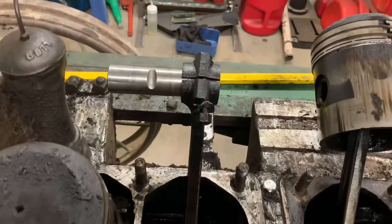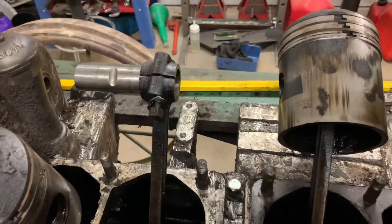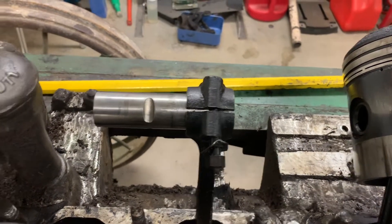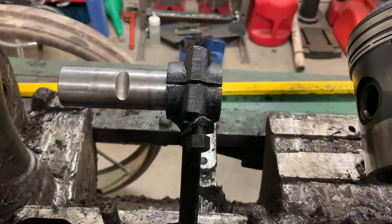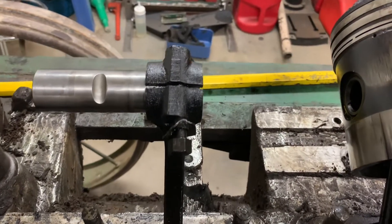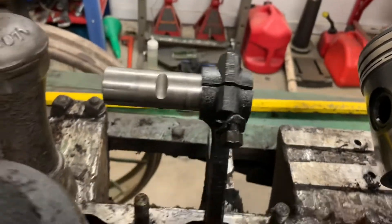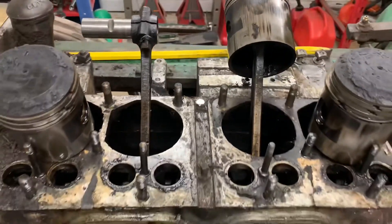There's a lot of unusual design in here. Typically the wrist pins are held in with snap rings on the end, but the tops of the connecting rods in this engine are split, and the wrist pin is machined with a bolt that goes through and locates it, keeping it from sliding out. You slide it in with the bolt out, the bolt retains it, and then they hammer a fold-over lock over it. Haven't seen that before — kind of interesting.